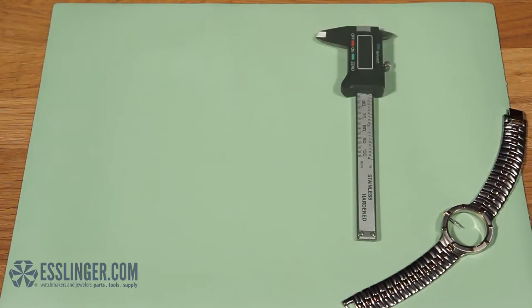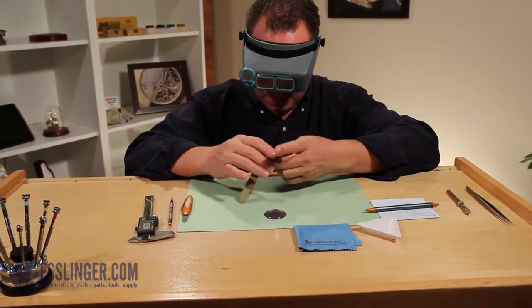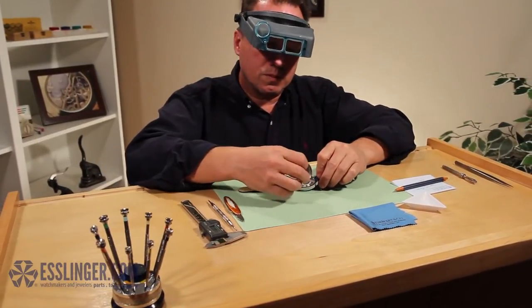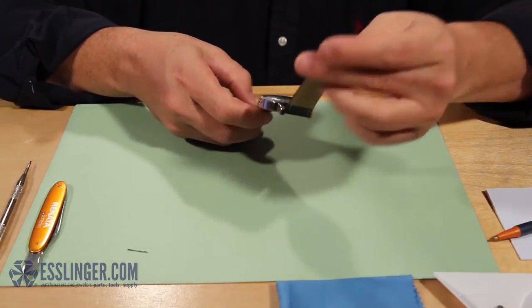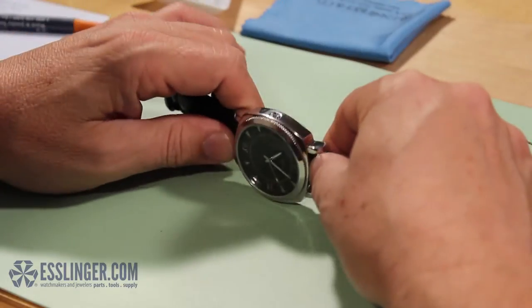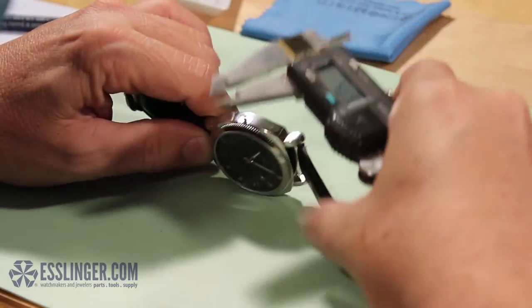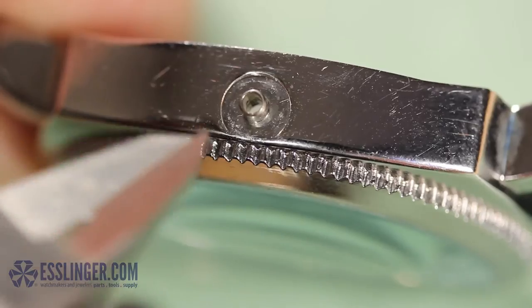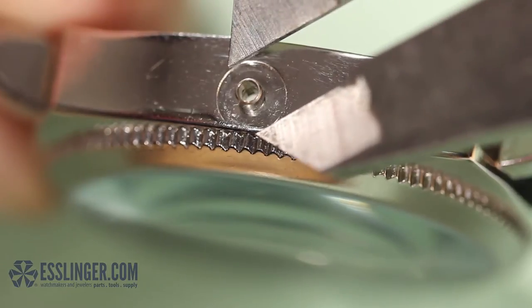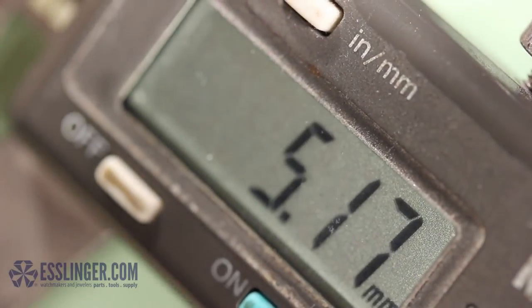You'll need a digital gauge and a notepad and pen. The first thing you need to do is determine the diameter of the missing watch crown. Hold the watch case in your hand so the hole where the crown used to be is clearly visible and easily accessible. You should see a small cutout or indent around the hole for the watch stem where the crown would sit — this is the diameter you will measure. Take your gauge, position the jaws over the indent, and open them until they stretch snugly from one edge of the indent to the other. Repeat this measurement to ensure accuracy, then record the diameter on your notepad.